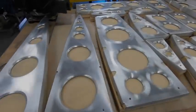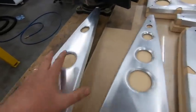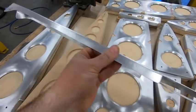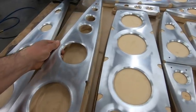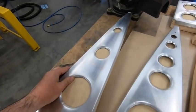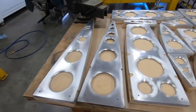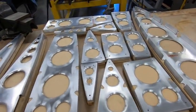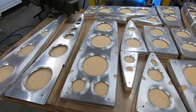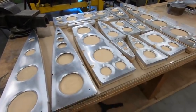Everything is polished up — the last little bit of fit and finish is done. You didn't miss anything, it's just sitting there with some sandpaper and a file, but all the edges are cleaned up. This is the second piece that I didn't really show you too much after the lightning holes, but it came out quite nice. A lot easier to work material when it's 40 thou as opposed to 32 — 32 is getting pretty thin and it takes marks quite easily. These are the two that were just completed, and these are all of the other horizontal ribs that go on the fin. That completes the bulk of the internal structure for the fin, and allows us to get all of the shaped components produced in O material off for heat treatment at Pyrotec with our fuselage splice plates.